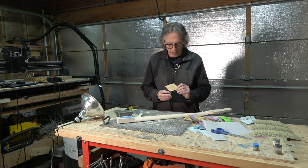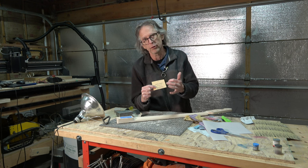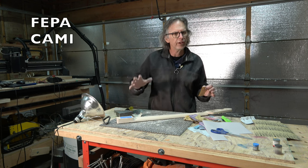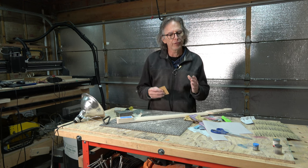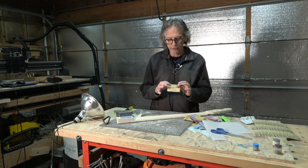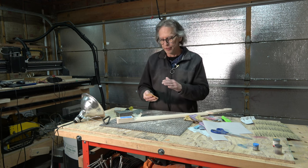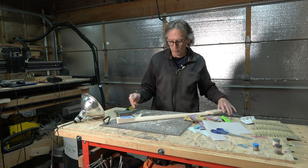One thing I should mention is the sandpaper I'm using is P grade sandpaper — you can tell because it has the letter P in front of the grit designation. That is a FEPA standard sandpaper. There's basically FEPA standard and CAMI standard, and there are other standards out there as well — I know there's a standard used by the Japanese and probably many others — but the most common right now throughout the world is FEPA and CAMI. I like to use the FEPA, which is the P grade, the European designation, because the grit sizes are consistent. Whereas with CAMI it's not quite as consistent, and as a result with P grade sandpapers I get a better quality of finish. That's typically what I use on just about every bit of my sanding work on my guitars.